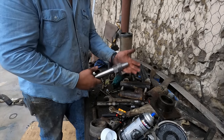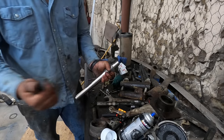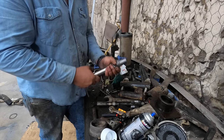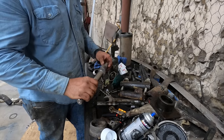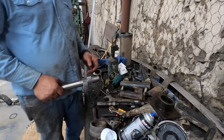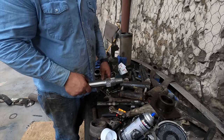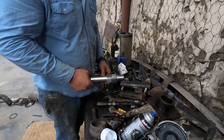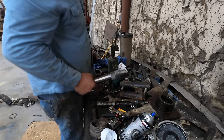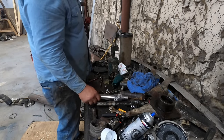Here is the new high-speed gear I got. If this doesn't show the awesomeness of American manufacturing — and I don't mean the American brand we're working on, but like America — I don't know what does. I called the shop that I buy stuff like this from and said I need a high-speed gear for an 18 American. Remember, this thing was built in '57. He says okay, is it a long shaft or short shaft? Does the shaft come out both sides of the gearbox or is one side blind? I said it's one side blind. He goes, okay, it's $530, I'll have it the day after tomorrow. They built these for 70 years, all exactly the same because they were designed well to begin with, and there was no reason to change them.